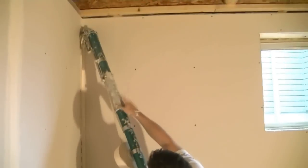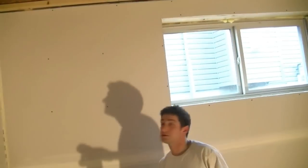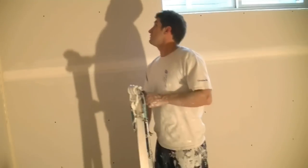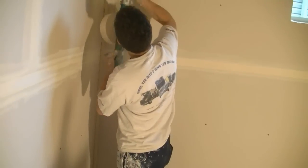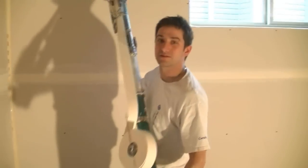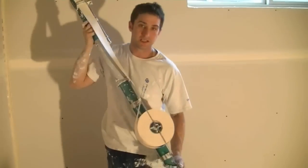I'm going to take it close to the top and then cut it. What he did at the top there is use the creaser wheel to finish it off, because when you cut it, it's a little bit less. You usually hold the creaser wheel all the way up until you're done. Make sure your hand always has a little bit of pressure on the creaser wheel at all times — it runs a little bit straighter and nicer.